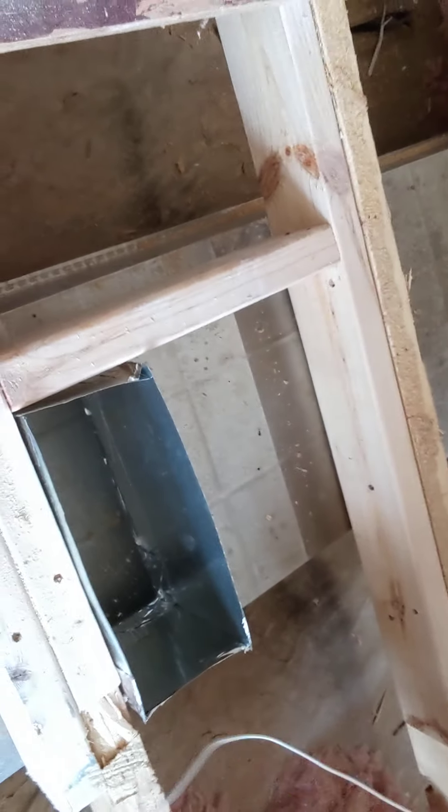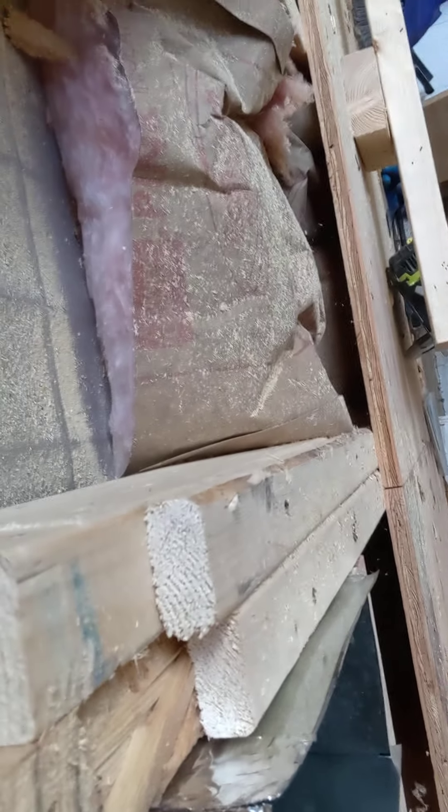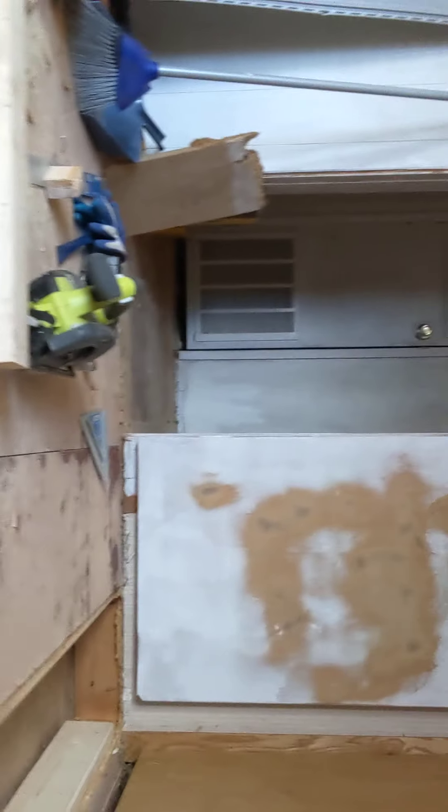I'm going to go across — like this one that we built for the heating duct here. Also, these joists — not only are they strangely glued and stapled a bazillion times — but every couple of joists are about a quarter inch lower than the others. So what we've had to do is put in a whole bunch of strapping to make up for that and keep the floor at a level that should be leveled.